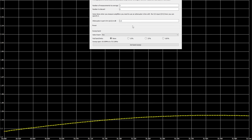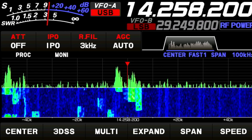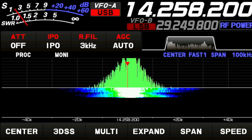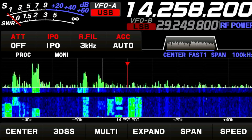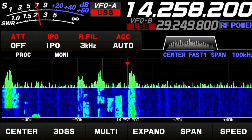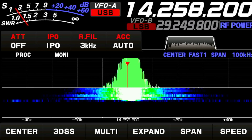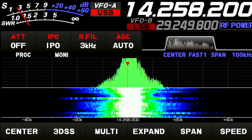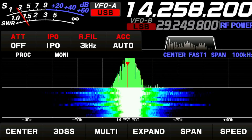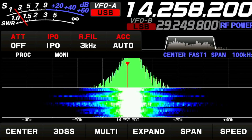With the antenna checked for SWR on all bands, let's go ahead and make a contact. A station from Croatia — Sam, about 70 kilometres north of Zagreb — called in with a 5.9 plus signal report. I responded that he was also 5.9 plus 20, and explained I was just testing a new multiband cobweb antenna I got from a fellow ham in Poland, up about 6 metres and running 100 watts from a FTDX10.